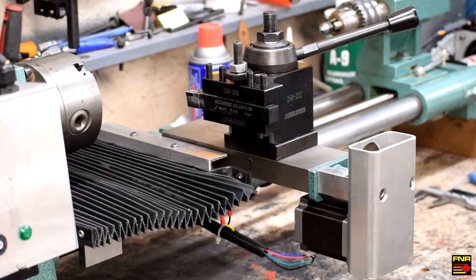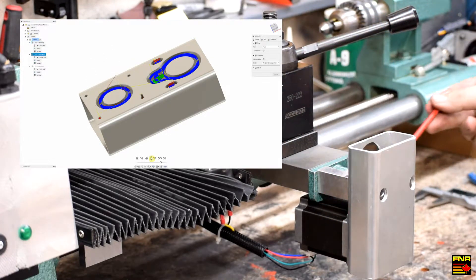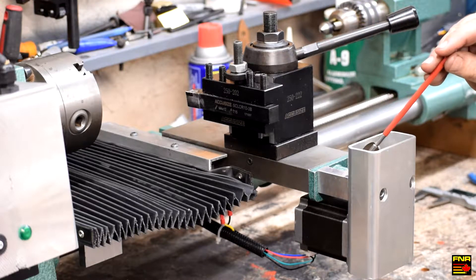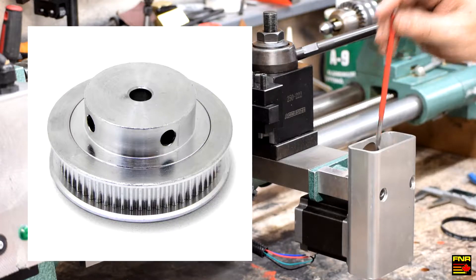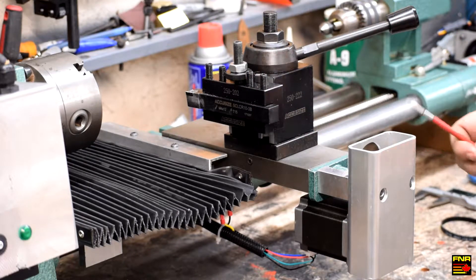The part that's probably the easiest to notice is that we now have this x-axis housing up here. I have this aluminum extrusion — using the X-Carve I cut on the back a NEMA 23 mount flange, tapped the holes so that the stepper motor just screws onto it, and there's a pass-through cut on the back that allows me to put through a GT2 timing belt, with a 60-tooth cog on the top and a 30-tooth cog on the bottom. There's a little slot here and here so the bolts that go through it — this whole assembly can move up and down to tighten the belts.